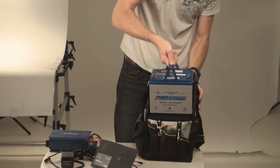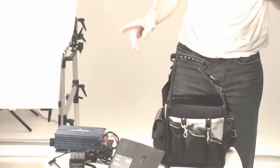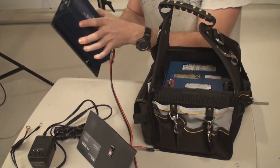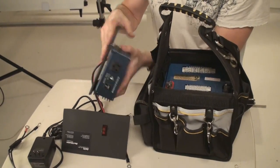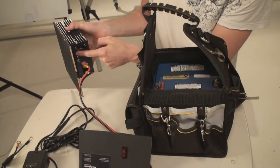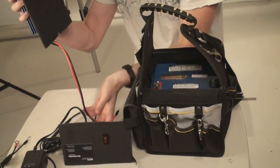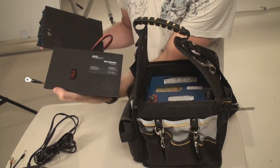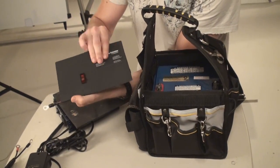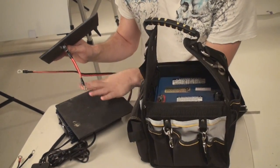Let's pack it. The battery goes in first. We got the battery in here. I also mounted the inverter on the same wooden plate, so it has a gap for cooling. It has a fan here and the second opening is right there. This will be our cover for the battery. I have all my information here — it's actually my plastic business card, I just stuck it here. And there's a main switch to disconnect the battery from the inverter.